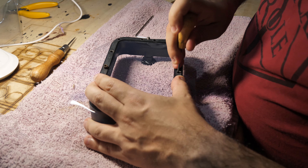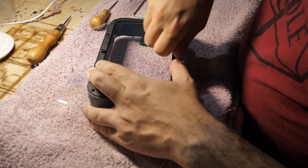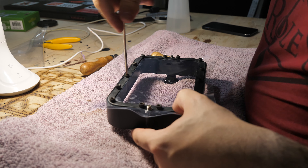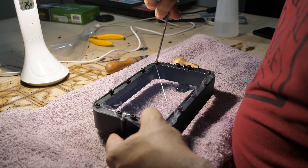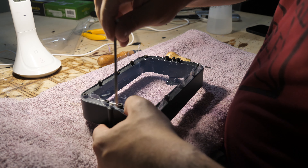With those holes ready, I started putting in screws gently, hand-tightening them until they would not go down any further. I did opposite screws — so if I did the top one, next I did the bottom one — and went around the whole frame. Once the whole frame was completely screwed in but not tight, I went around with the allen key and tightened them again bit by bit, not all in one go, just a little at a time until they were nice and tight.